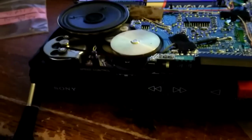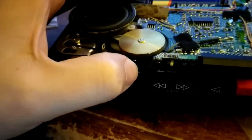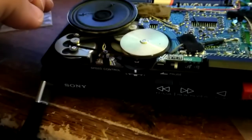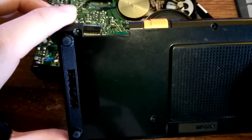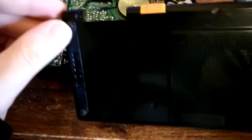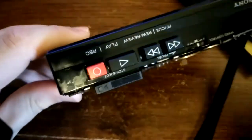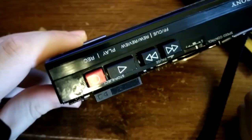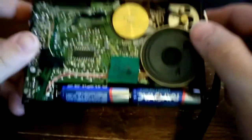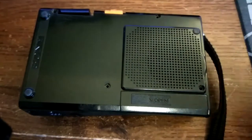If you have the TCM-17 and a belt that doesn't quite fit right, it might change your playback speed. As long as your playback smoothness is good, you're fine because it has speed control. Also, when you apply your glue, make sure you're not getting it all over your fingers. I had to re-glue one of the feet and got glue all over the edge — that stuff will melt and bond to plastic. If you're trying to keep it clean and it gets spots like that on there, there's pretty much nothing you can do except try really fine sandpaper and polish it out, and that's probably not going to happen. It's a cheap tape recorder from the 80s — try to take care of it in the first place. Anyway, thanks for watching.